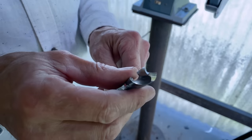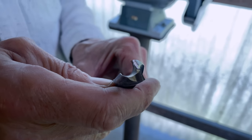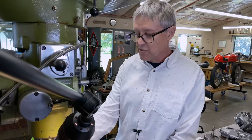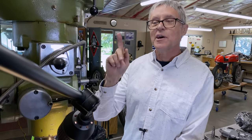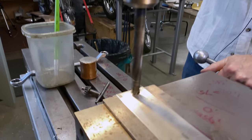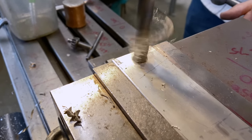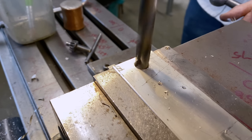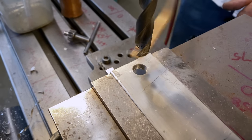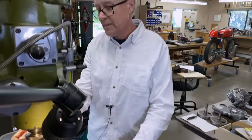I've sharpened this drill. It's a 31/64, almost half inch. I got the mill set up — let's go see how this cuts. I've got a piece of aluminum in the vise and basically a half inch drill. We're running at 650 RPM. Put a little bit of oil on the drill. There's the hole — that drilled through quite nicely, so that's a sharp drill.